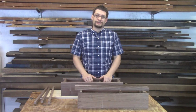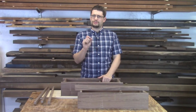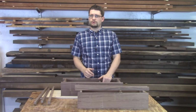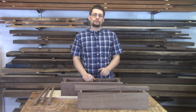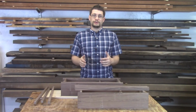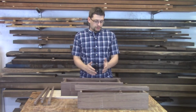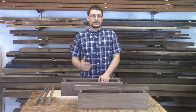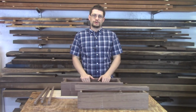Well, you try out a new blade. So I bought one of the Tenryu Gold Master blades. It's a thin kerf blade, so slightly less than a full 1/8 of an inch. And so far so good. I had to readjust the fence on the table saw as well as the miter sled to re-zero them out so that when I do my ripping and cutting, everything's at the correct dimensions for the thinner blade. So far the blade works really well. I've cut a number of parts for the cabinets on it. I'm liking it. I'll have a larger review about the blade in another episode.